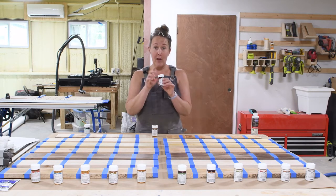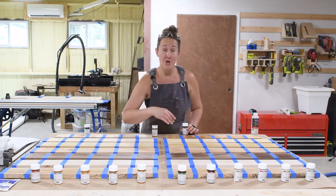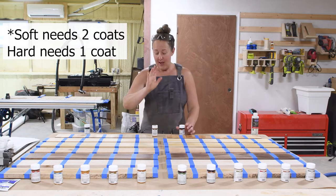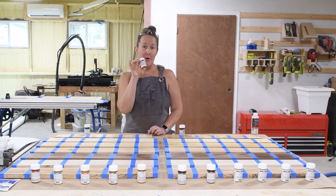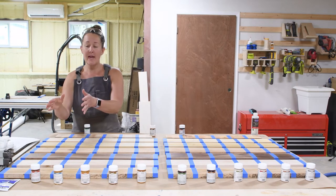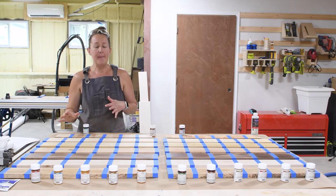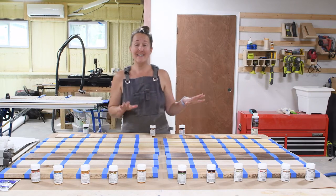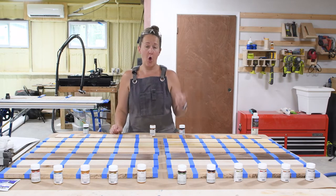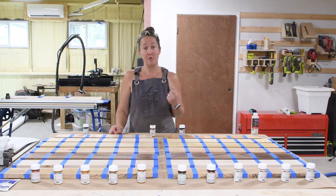The same thing goes with the original — for the softer woods we're only going to add one coat, and for the harder ones we're going to add two. The buff-in finish only needs one coat of the stain, which is your pre-sealer. And for the marine, all woods are getting two coats of our sealer. We're going to apply those all today, and I'll come back tomorrow and apply the second coat for all the ones that need it, because it does require a 24-hour period of dry time.